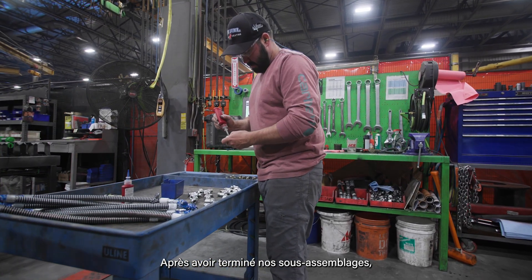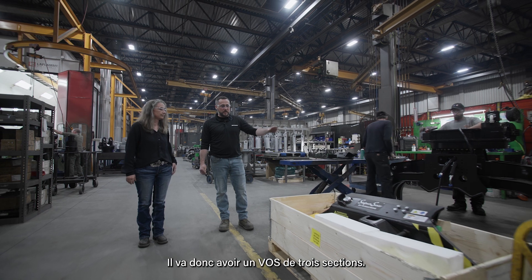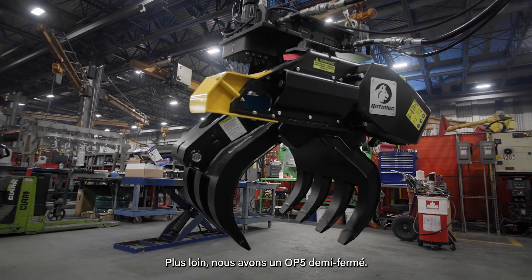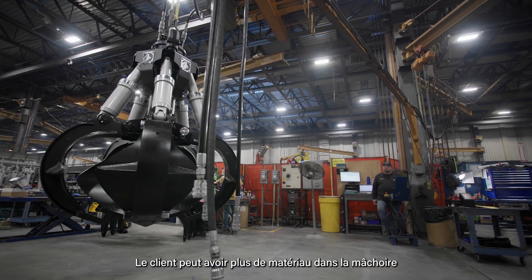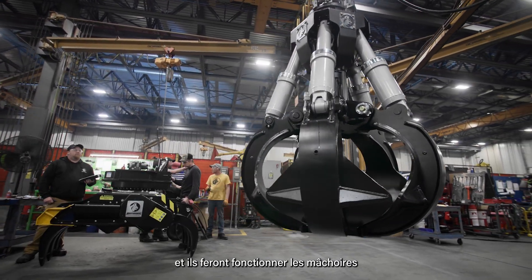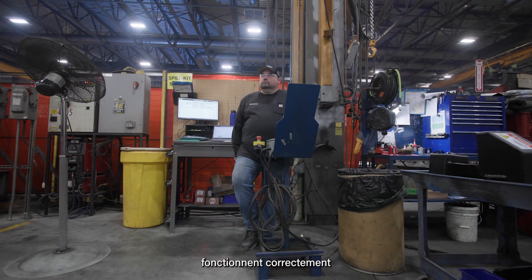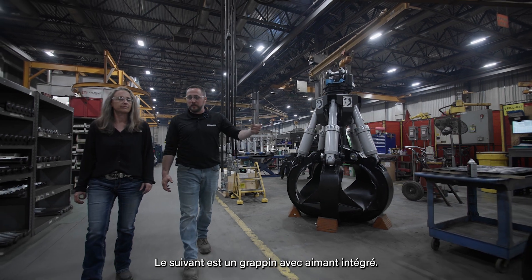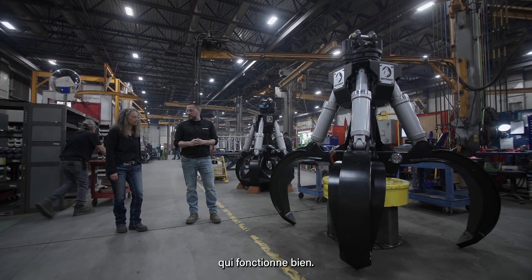After we finish our sub-assemblies, we move into the main assembly of the grapple. Finishing up an RPA here — it's an RPA 3045 with a saw on it, so it's going to have a section three. Once they're done, they'll put the saw on and test the saw along with the unit at the same time. Moving down, we have an OP5 half-close. The half-close allows the customer to get more material into the jaw when doing their work. They'll hook it up to the hydraulics and run the throw on the jaws to make sure it's opening and closing — this is where you actually test the cylinders as well, making sure they're operating properly before it goes out to the customer. This next one has a magnet on the bottom — it's one of our mag grabs, used primarily in scrap yards, and it's something that's been working well for customers for a while.